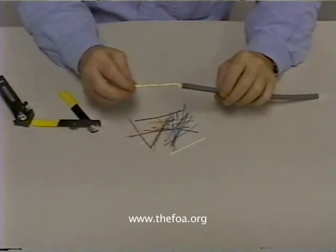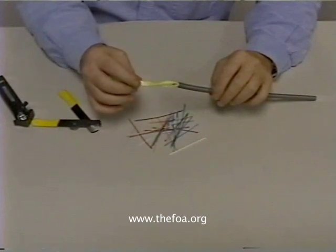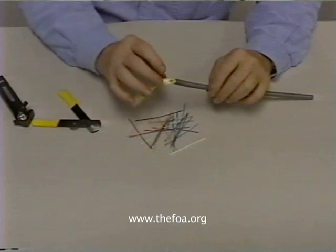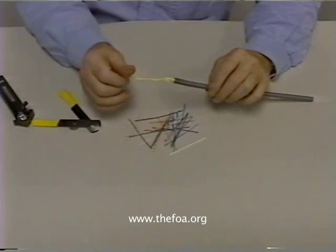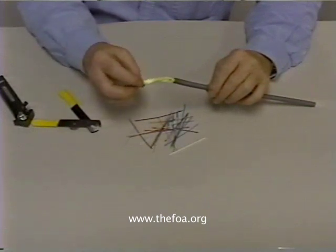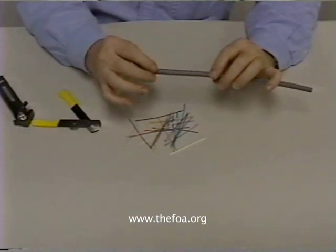This is a very simple cable and it's widely used in building backbones. One thing about this cable, though, is that it's an indoor cable — it's not designed to go outdoors because there's no water blocking in the cable. There are some new designs now available that are dry water blocked. They use a special material that absorbs moisture and expands to about 100 times its size — it's actually the same material used in disposable diapers. So if you go to your cable maker and ask for a water-blocked dry cable, they can make you a distribution cable like this that does not have gel in it like some outside plant cables, but will actually have a dry water-blocked material.